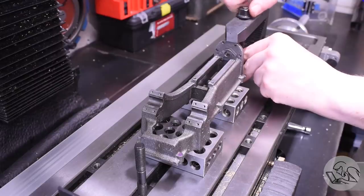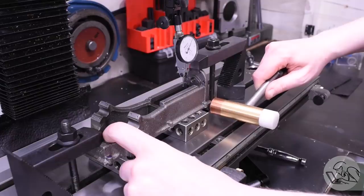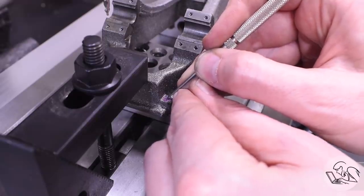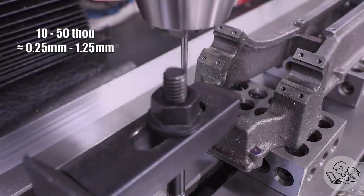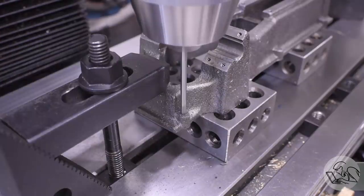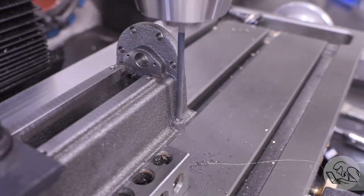To mount the engine on the base, I'm going to have to finally drill out those bosses that people have been asking me to drill out for about six months or so. I set this up on the mill and lined it up on the crosshead rail there as usual. I tried measuring these and it didn't work very well. What seemed to work the best was honestly just eyeballing the center of the first boss. Once I was happy with the position of that, I tried using the DRO to locate the other bolt holes, but following the drawing, they seem to be off by between 10 and 50 thou — some of them quite off. So there's something fishy with the casting. I just noted the DRO positions of each one so I could come back and drill them through after center drilling, and that worked out great.